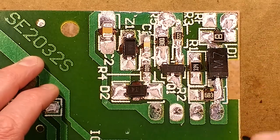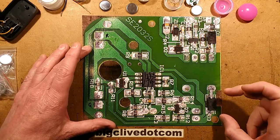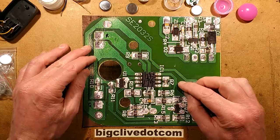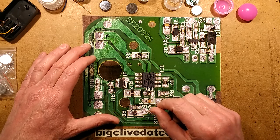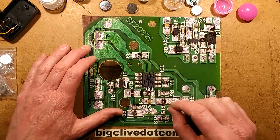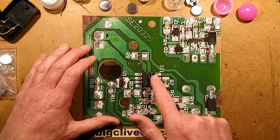It's got feedback. Let's look at the schematic. The circuit is in three sections. First is the power supply: the mains comes in, live goes through a 10-ohm resistor which acts as an inrush current limiter and fuse, then through a big diode to one end of the primary winding. The primary is switched by a transistor — a very ordinary transistor — and on the emitter there's a 30-ohm resistor. There's also a 431 programmable shunt regulator, which with its pins shorted together operates at its default 2.5-volt reference voltage.